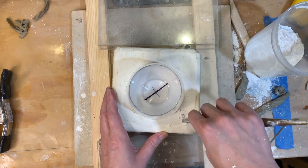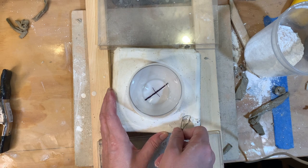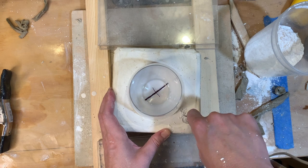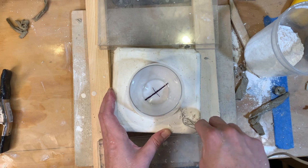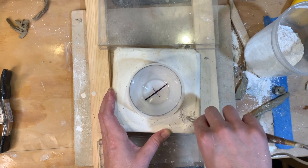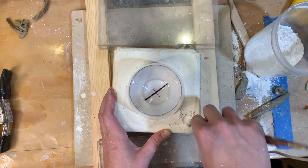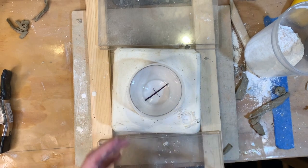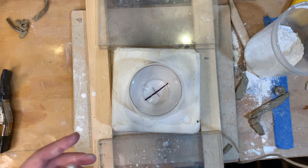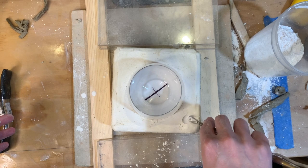We don't want to encroach upon that center line of where your actual mold line comes touching the piece. But I do want to make sure that I have a nice shallow disc in there, and I'm going to put on 4 of them, but nothing hard and no 90-degree angles. Everything should be kind of a low, shallow divot, otherwise they pop off and you lose your keys.